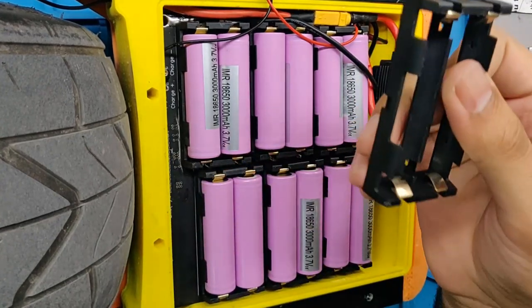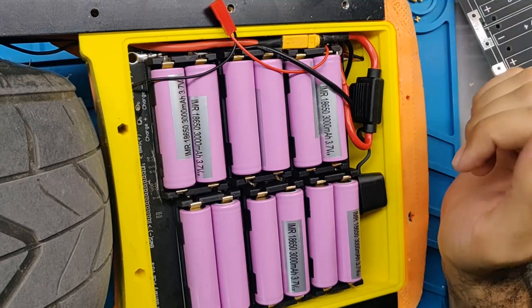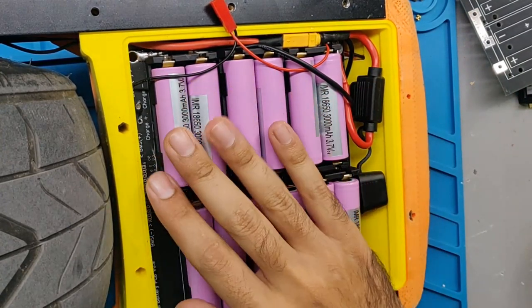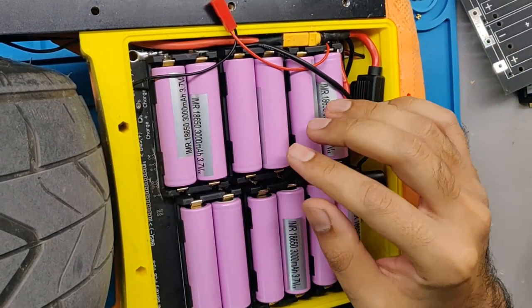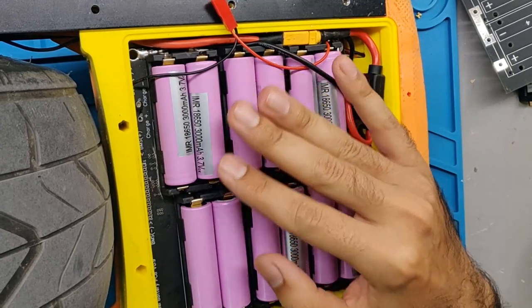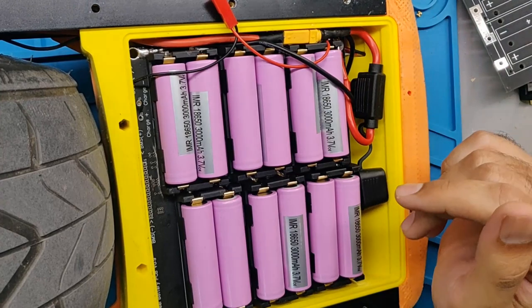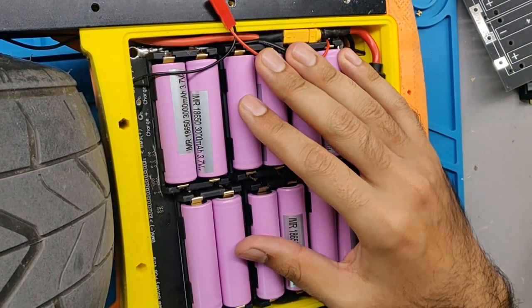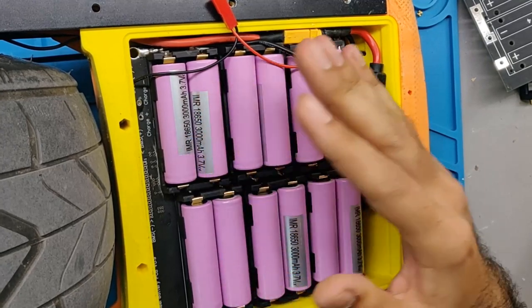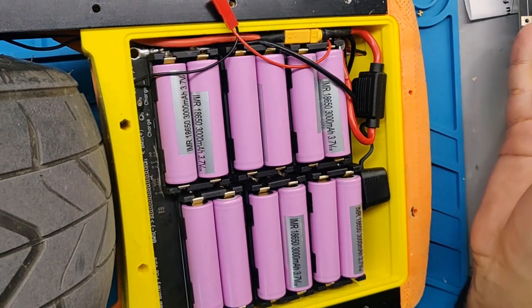So when can this go into production? I still have a couple of things to figure out. First is the battery management system — I'm looking for a BMS small enough to fit in one of the gaps or at the front. The other issue is cell-level fuses, meaning every cell connecting to the next has a fuse so that if something bad happens, the fuse blows and isolates that cell. The challenge is that there's basically no space for fuses, and they'd also increase cost. Once those are resolved, I'd be confident to bring this to market. I'll keep you guys updated — thanks for watching, keep fungineering, and I'll see you next time.